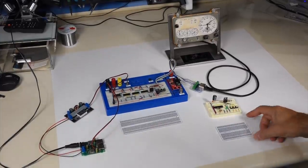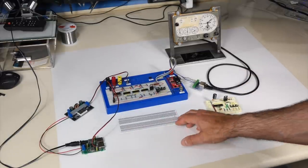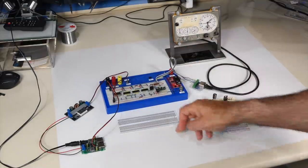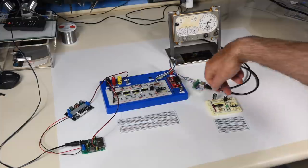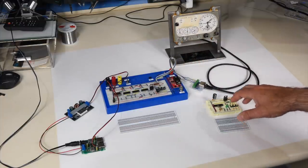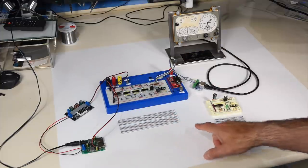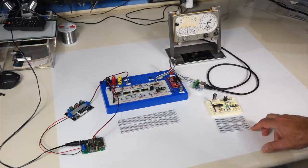And once you're done with the prototype, well, just take one of those little boards from Adafruit, the kind of perma proto. It's just not worth it to make a PCB for a one-off, so I'll just solder that design onto this board and this one onto this board. And I think, since they are equivalent, I'll use this one. It takes less space. If I were to put it in a transparent case, I would probably use this design because it's so beautiful. You can explain what it does. But in this case, it's going to be hidden, so I think I'm going to use this design.